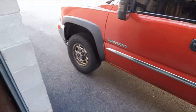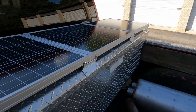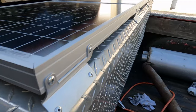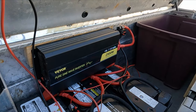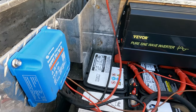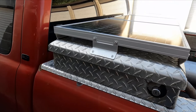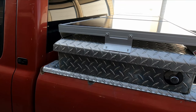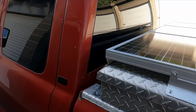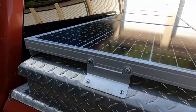As of right now, if you saw any of my other videos, I have a solar powered truck toolbox. If you haven't seen it, go check out those other videos. I have a 2500 watt pure sine wave inverter, three AGM batteries, wired to a Victron MPPT solar charge controller, and a 12 volt outlet from the batteries running into the cab of the truck for unlimited power to my ice cold cooler that I just leave in the truck all the time.